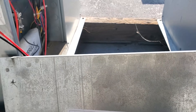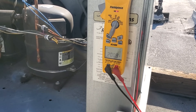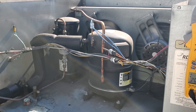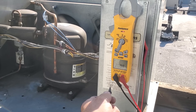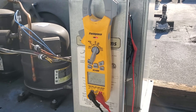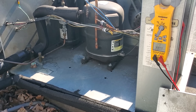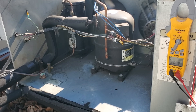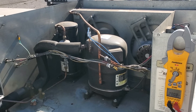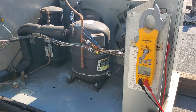While I was talking, all of a sudden it turned on. Why? That's very interesting. Condenser fan motors are running and we have 208 volts at the compressor contactor coil. Why is the question? I need to put some service gauges on this guy — I don't know if it was off on a high pressure lockout or what. And there it goes — it just shut off. Very interesting.